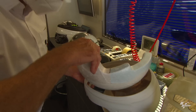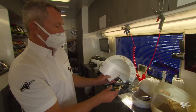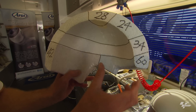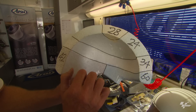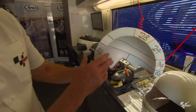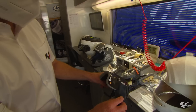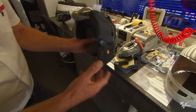There's a real art to putting in the styrofoam — it's in one piece inside here. There's a bit of technology involved too, because there are different densities. Around the vision area it has to be harder so it doesn't compress too easily in an impact, while other areas have different densities where more absorption over a bigger area is needed.